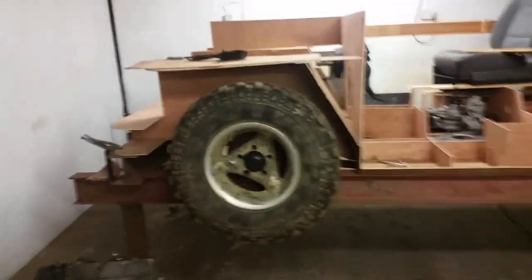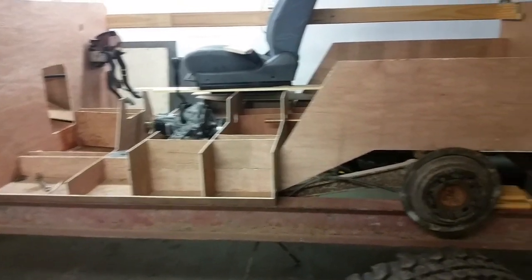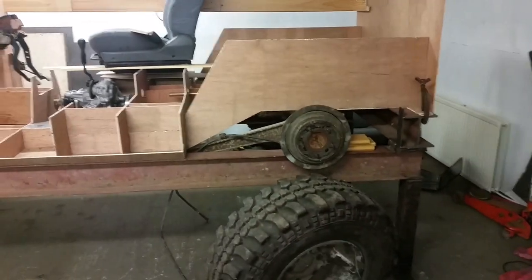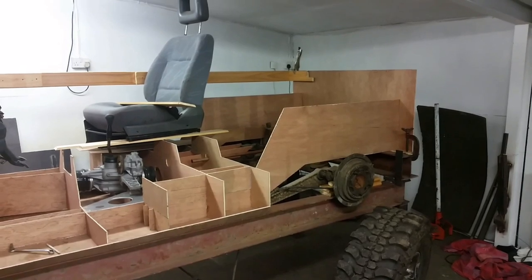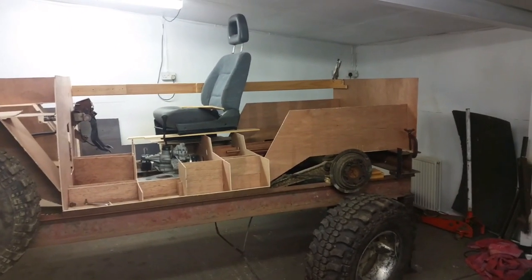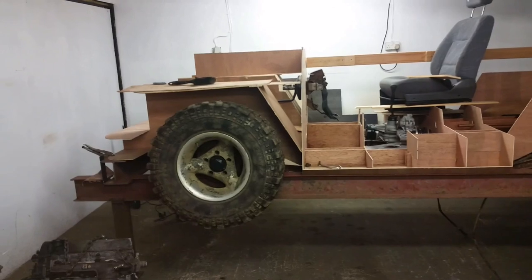I've lifted the jig up on the legs now. Once it's fully welded I'll fill it with water and go around with a pen and mark all the leaks - there'll probably be hundreds. Empty it, re-weld it, check it again. It's getting quite close now. I'm going to spend the afternoon finishing the wood mock-up - try and get the rest of the wood and maybe a side on there. We're getting close to the point where this is as far as I'm going to go with the wood. Then it'll be order a few expensive sheets of aluminium and get the CNC fired up and start building this.